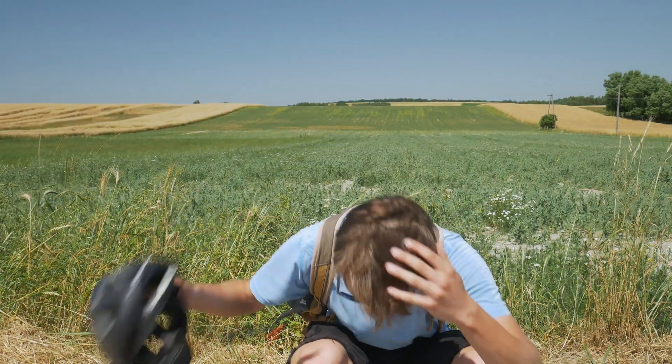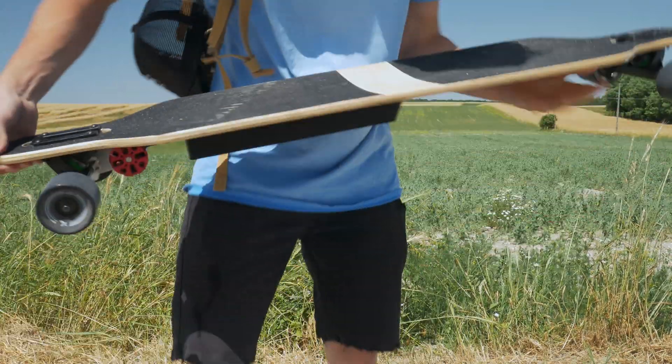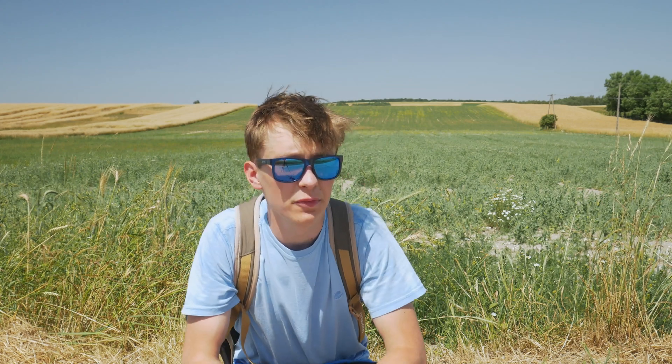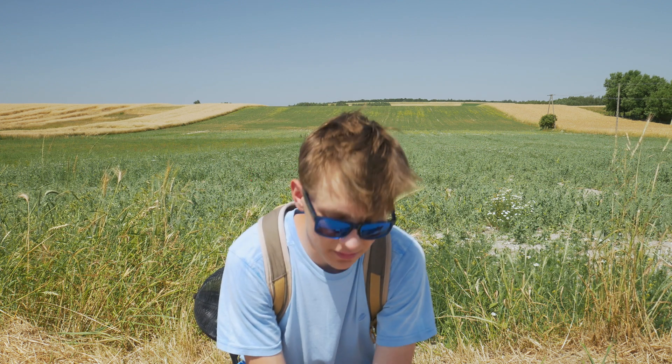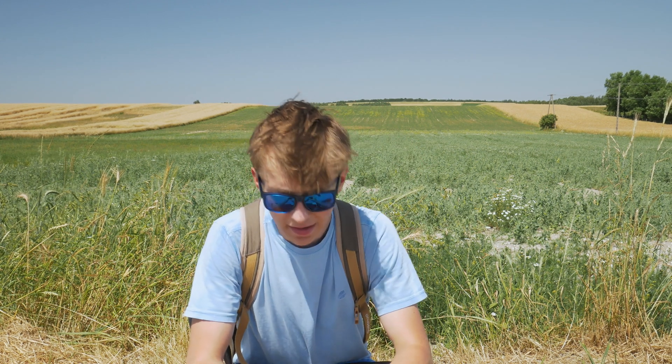I think that's it — there is no more battery left in the skateboard. The battery level monitor shows just one stripe and when you try to ride it, it shuts down the motor, so the battery level protection works really well. I made 15 kilometers — really not that bad, considering there were quite a lot of steep hills. On flat ground it would be closer to 20 probably, so the range is quite decent. I should also mention that I used second-hand batteries — someone online sells batteries from old laptops, and those are quite nice because they were well protected inside the laptop batteries and they are a lot cheaper than new 18650. For new batteries I would have to pay about $100, but for those I paid just $30, so it's really worth trying out.